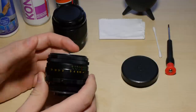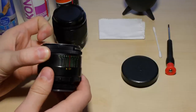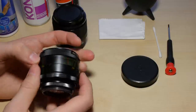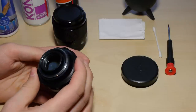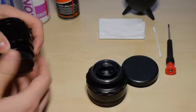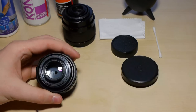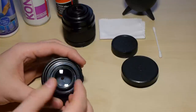This is not the latest KMZ edition, which is a little different but not that different. If you have a similar one with slightly brighter green, red, and yellow printing, it's one of the newer ones. The newer ones also have a serial number; the older ones don't. But they are nearly the same, so don't expect a completely different lens. Let's look at the back — the back is nearly the same on every lens of this M42 series. You can see the lens element here and you can remove the complete optical element at the back by unscrewing the complete back of the lens.